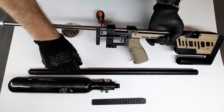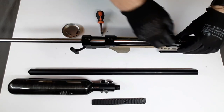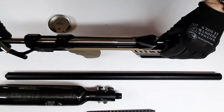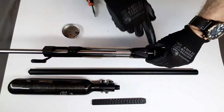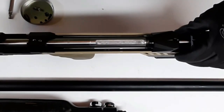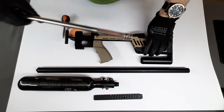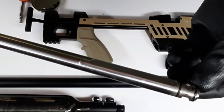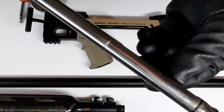So now you've got the barrel. What you want to do is — there's another little socket screw right there. So it goes there, and you can see where the indent for the barrel is, and now the barrel just pulls out the front. And then you can see the massive transfer port that this barrel has. It's quite a unique design — I haven't seen one quite like that. It's machined all the way through.